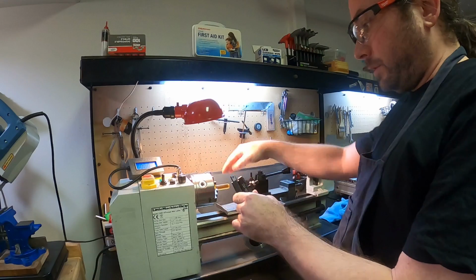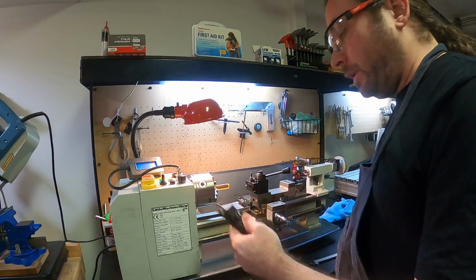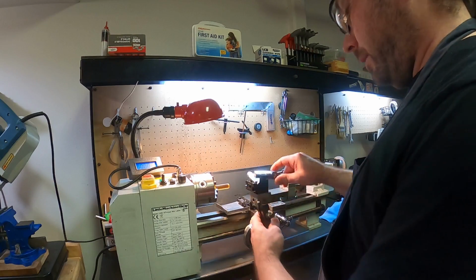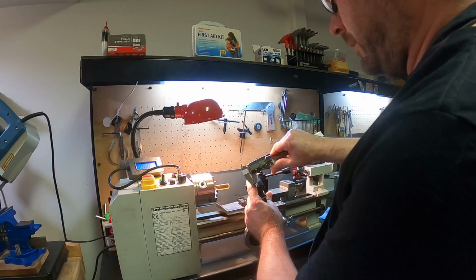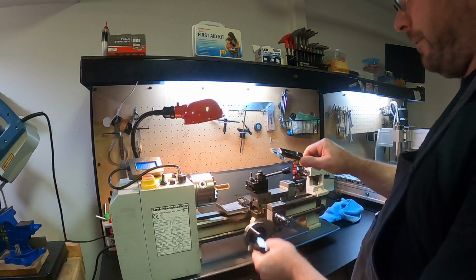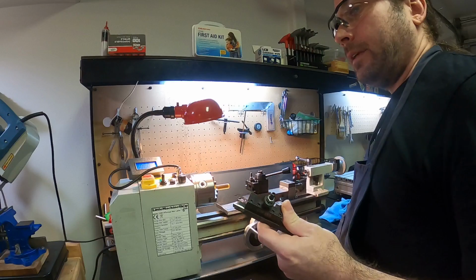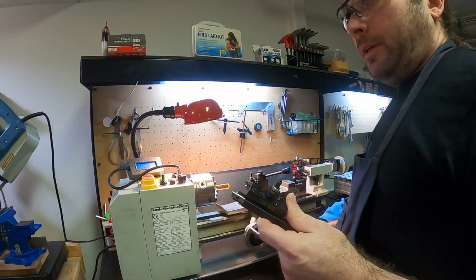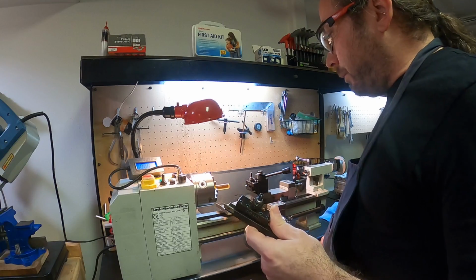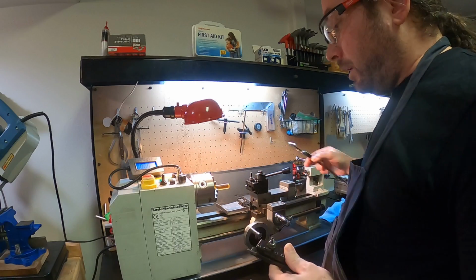this tool we're going to use to make the grooves where the wire goes in, we're also going to use to cut each one of the bobbins off as we create them. This tool has a width to it, so let's go ahead and measure it. I know what it is, but for chits and giggles, it's about 1.55. We need to account for that when we want to make a channel of a certain width, or when estimating how much I need to stick out.